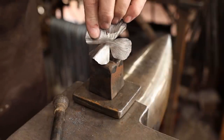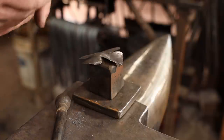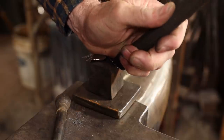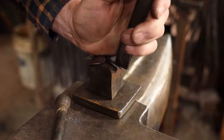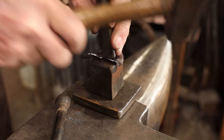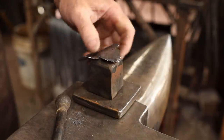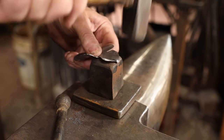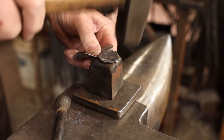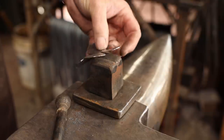That's what that starts like - not very interesting. I want to kind of roll that over. To do that I've got to put the palm of my hand to hold the back and kind of work the fuller around the front. I'm sure you can't see what I'm doing very well. That's a little bit more what I'm going for. I'll do that to all four.